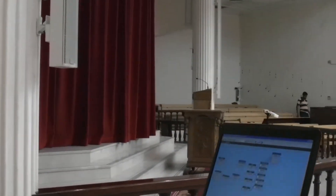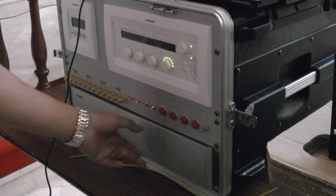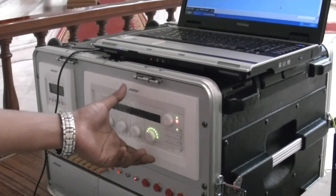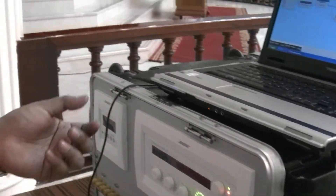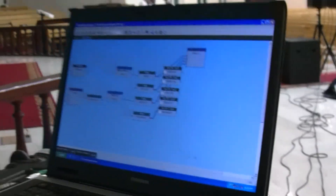Anandiya will just walk you through what we were doing. In the RT60 acoustic measurement, what we have done is we have used a control space processor, and along with that we have connected a C64 and we have run bursts of pink noise to the amplifiers, and through the amplifiers we are feeding to three A22s that you will see there.